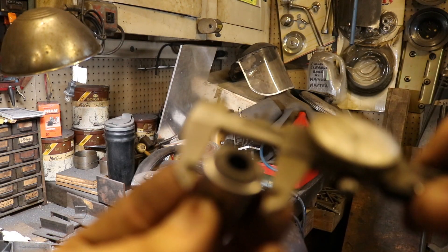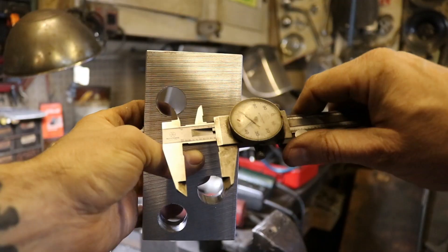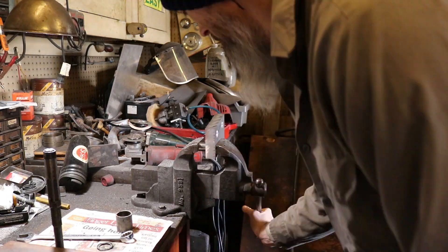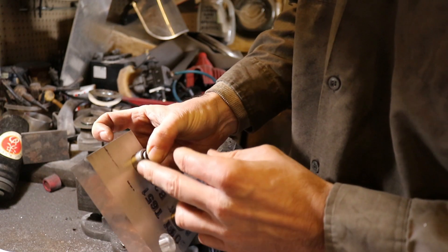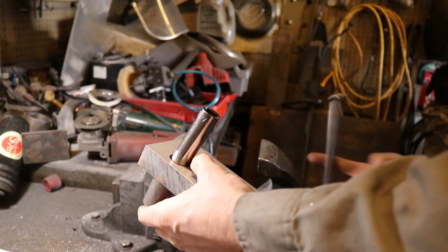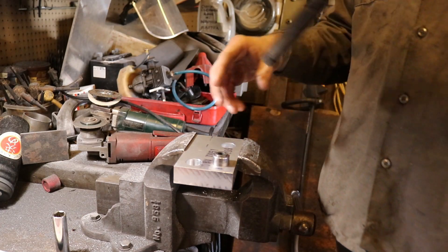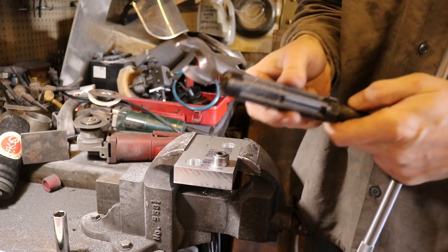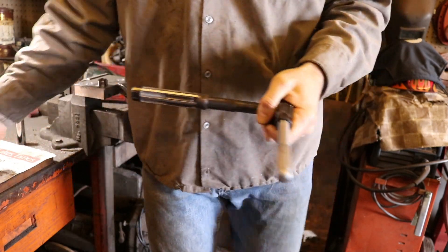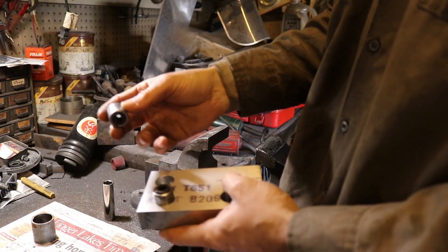My bearing is currently at 45 on the dial, and our hole for the bearing is at 44. We're ready to press the bearing in. This one feels a little bit tighter than that one, so I'm going to pop it out and ream this one again — changing the reamer just the slightest amount — and then try putting this bearing back in.